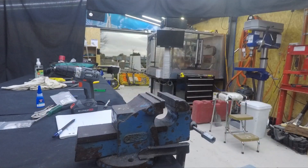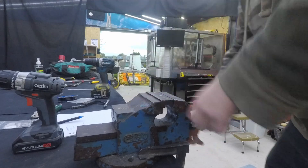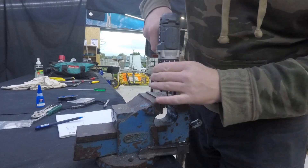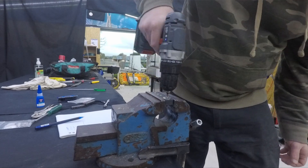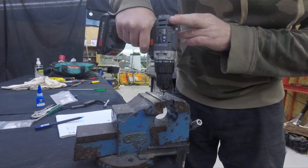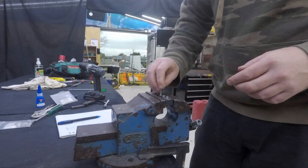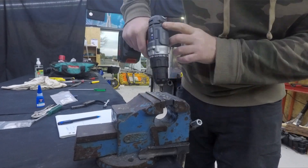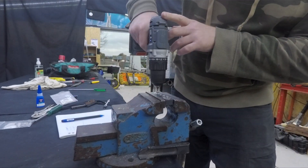The nutserts don't have that issue — they never seem to lock in the screw. And especially if you were to put the nutsert in so that the lip was on the inside, and then screw it so that it's tightening the lip against the face with the screw coming in from the other side, that's obviously going to tighten it up better and makes it even easier to unscrew the screw afterwards. For this demonstration I've tried to make a fairer comparison and put the lip on the outside, screwing in onto the lip side.